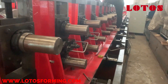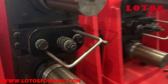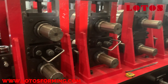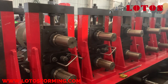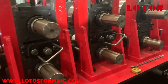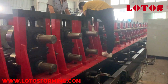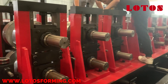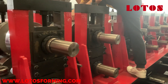This machine, as I said, is used for CZU, so we will use these rectangular adjusters to turn the roller and adjust the shape from C to Z. There are one, two, three, four, five rollers to turn and change the shape from C to Z.